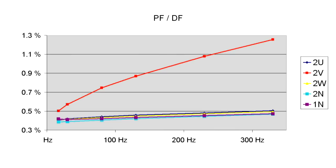Now we see an example where high frequencies enable a better diagnosis. Measuring 5 110 kV resin impregnated bushings, one measurement deviates considerably from the others. For small frequencies, the curves do not lie far from each other, but for higher frequencies they drift apart extremely. Here the dissipation factor or the power factor rises almost linearly with the frequency, and this behavior resembles that of a serial equivalent circuit.